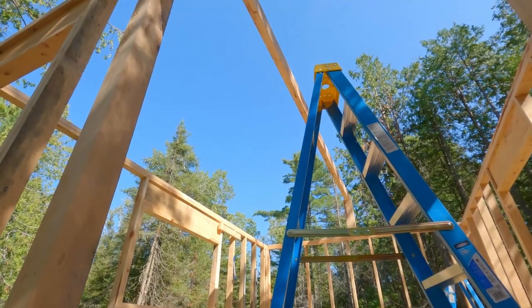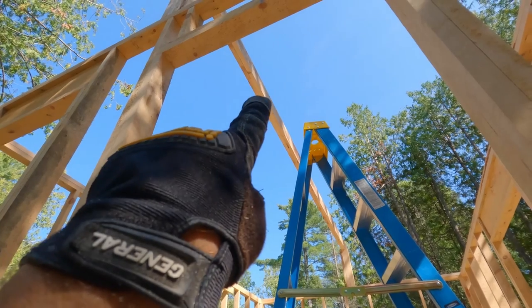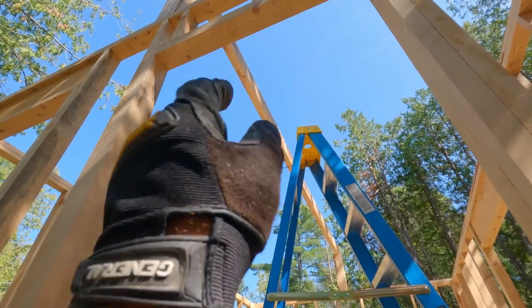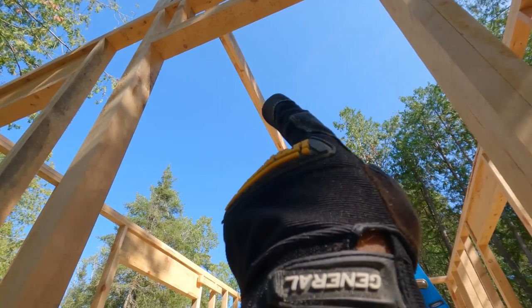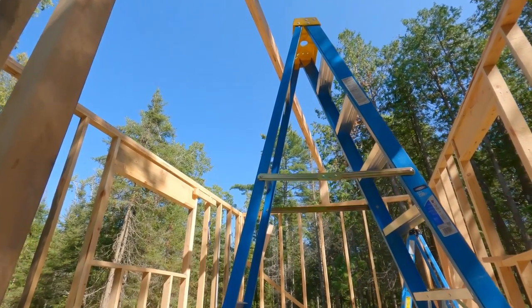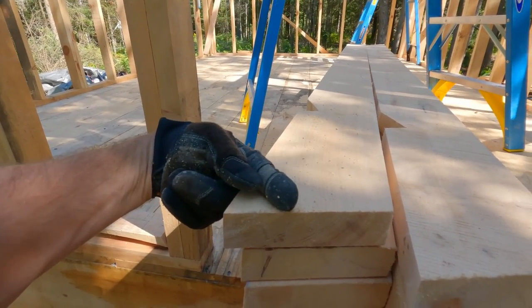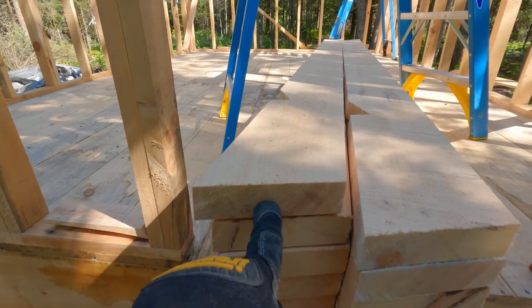Because you know, if it's ugly, then I won't bother cutting the last 3. One little hindrance I've just thought of is when I lay the rafters on that, that thing is now 3 inches thick. If I want to nail in from the other side, my 3 1/4 inch 16 penny nails aren't going to do it. I guess I could put one in just through here. I kind of need at least 1 or 2 more in there.